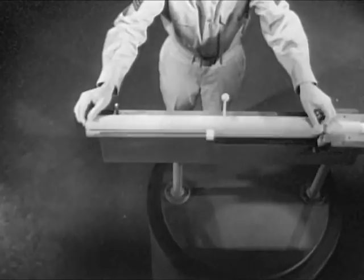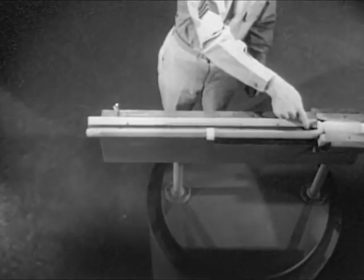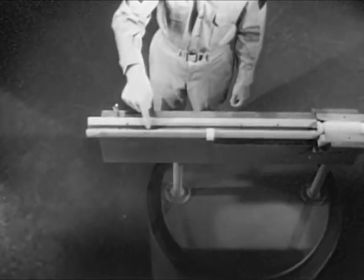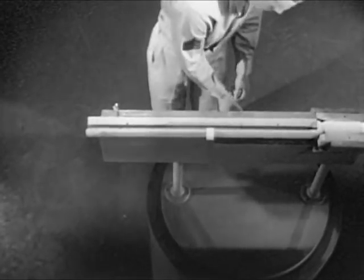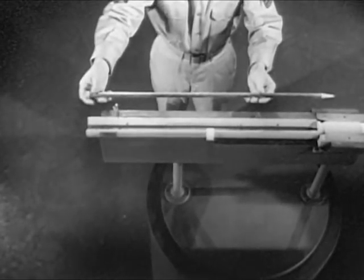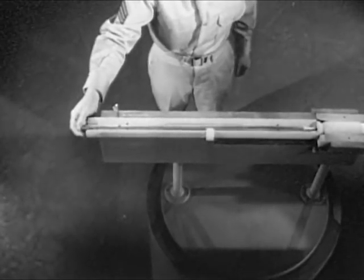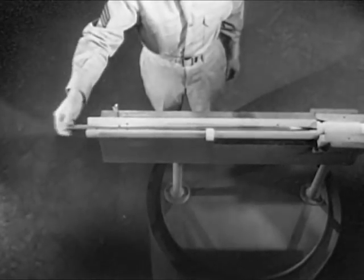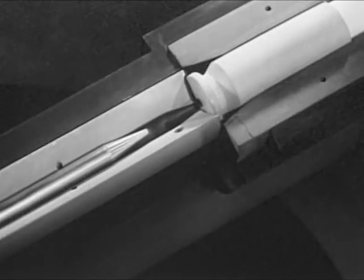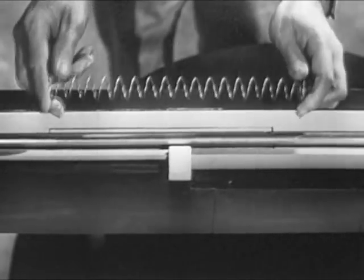This bolt was prepared for that. The top half can be removed. It has a channel running through its entire length. All that is needed is a rod to reach from one end to the other. This rod is called the firing pin. You'll notice that it is slightly longer than the bolt, so its point will extend a little beyond the face of the bolt. We can now strike the primer by driving the firing pin forward. One way to drive the firing pin is by using a spring.